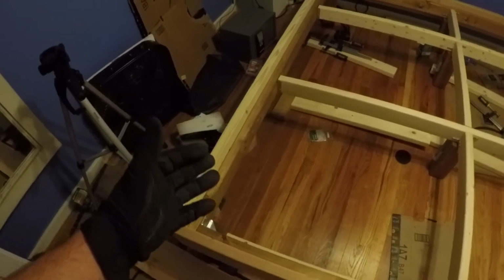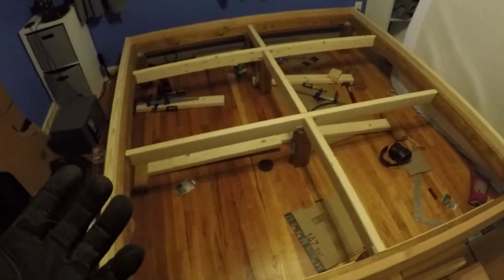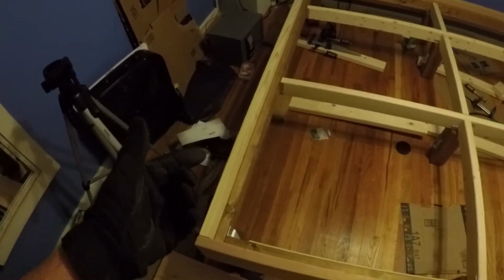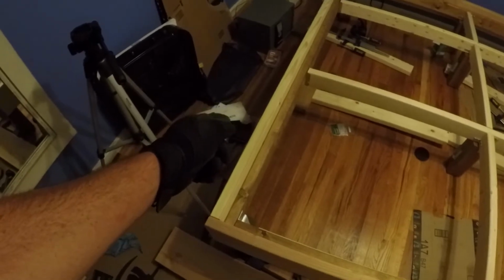So what I'm going to have to do is sand everything flush on the edges while it's assembled. That way I have no weird gaps and hooks here on the edge, both top and bottom. I got to do that for all 4 corners. Again, that's got to be while it's assembled. Then after that, when I take these back off to go stain them, I have to insert those bottom parts prior to reinstalling these sideboards.